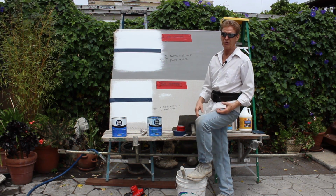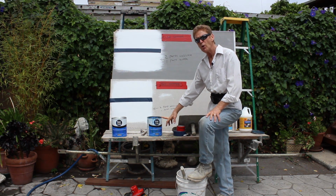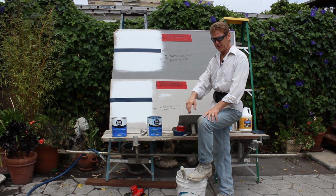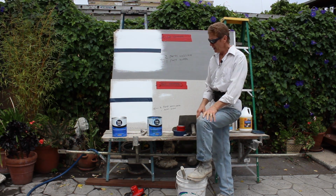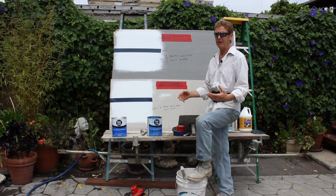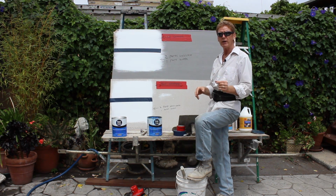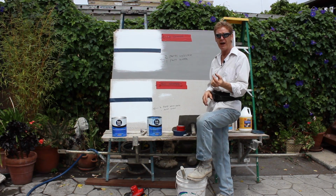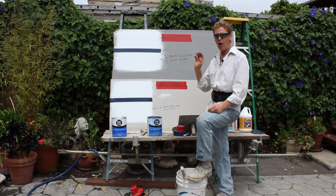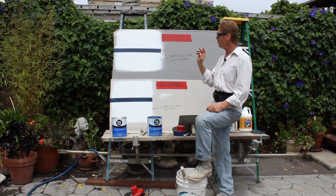In the early 80s, I was union, and everywhere we used Weld Crete for color coats, we diluted it a little bit. Now on the cans it says do not dilute, and that is because Weld Crete is engineered for going over sealed surfaces, and you put about a half inch of stucco on that. It has a lot of other uses, guys, like concrete to concrete, and you always go full strength when you do that.